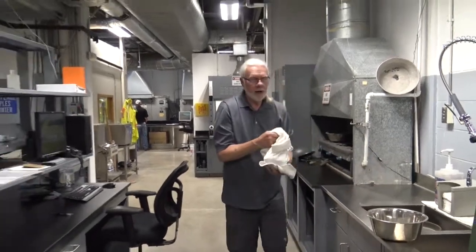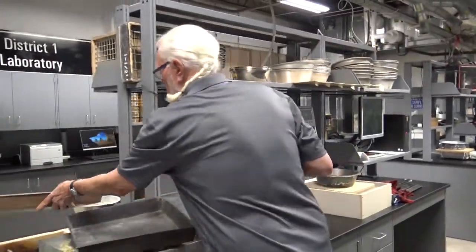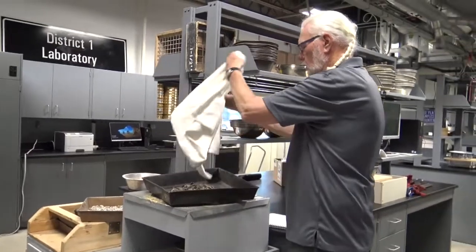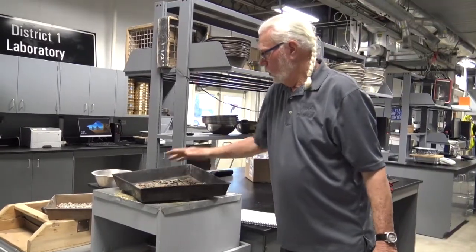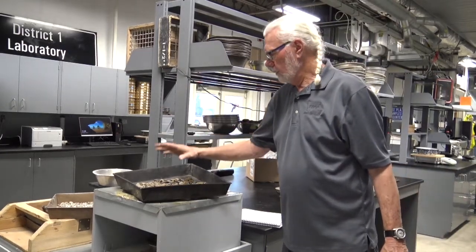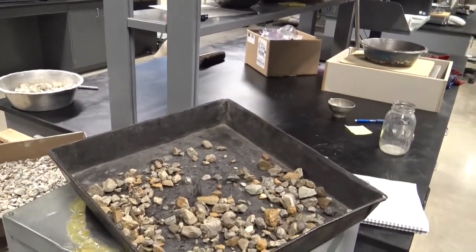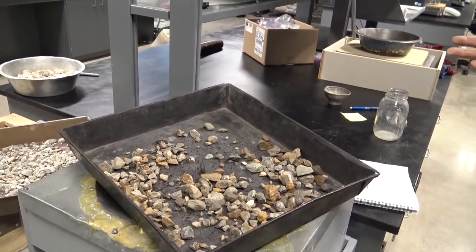After the towel drying, you need to take the material and spread it out onto a clean counter or a flat pan. Spread the material out and visually observe when it becomes saturated and surface dry. One of the things to watch for with coarse aggregate especially is when you quit seeing water streaks in the bottom of the pan, though it is judgmental. We are allowed to use a fan on it if needed, but we are not allowed to put it onto a heating unit of any kind.